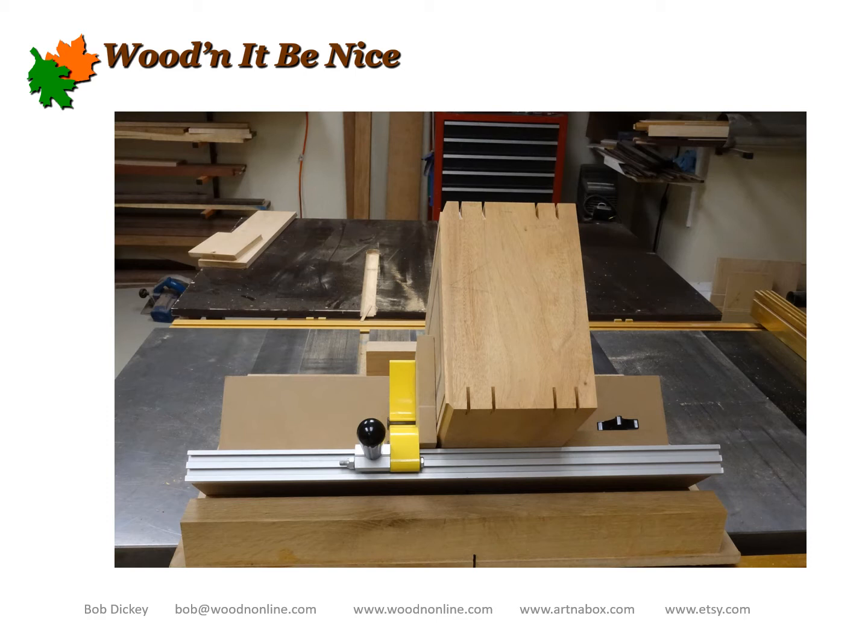For years I did this with a 24 tooth, 1/8 inch ripping blade. Actually, any manufacturer that I'm aware of has a flat top grind, so that blade works fine. You have to move a little bit slower because there are fewer teeth and you don't want to chip out, especially on some of the troublesome hardwoods. But they work fine as well.